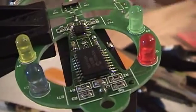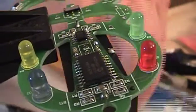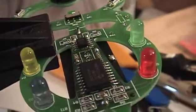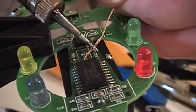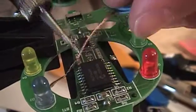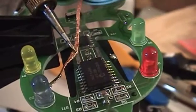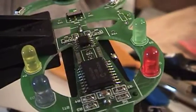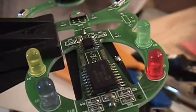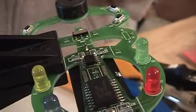We can push off some of the remaining solder or — even better — use our desoldering braid to suck up all the molten alloy on the pads. Just run the braid along the pads. Do be careful not to apply heat for too long, which could damage the board. Leave it on for just as long as you need to — a few seconds at a time. If something is really difficult, remove the heat, let things cool down, and then continue.